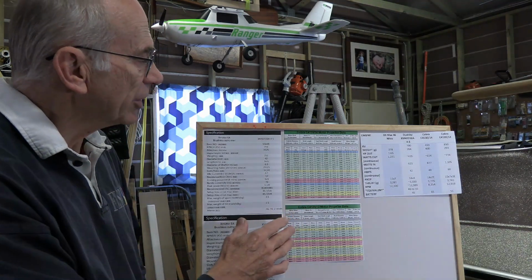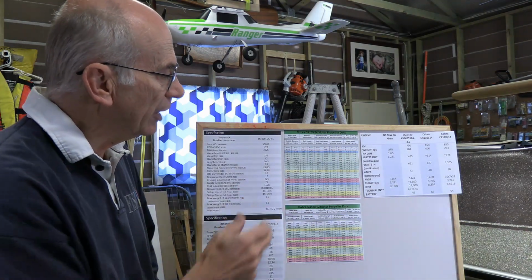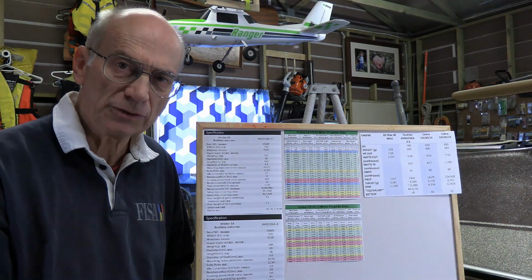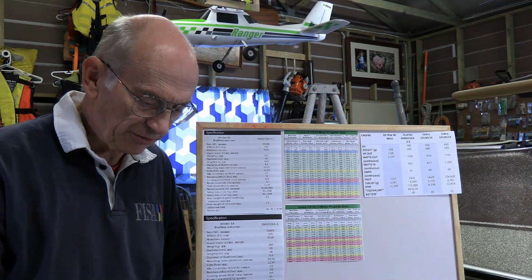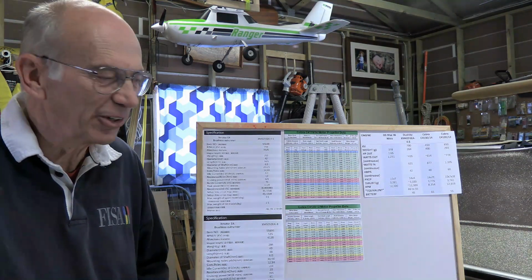Now, just thinking a little more about this chart, I mentioned the colors on it. The green is saying that it's running reasonably efficiently, and it's within the limits of the amperage the motor can handle. When you get into the yellow, it's saying that it's running very efficiently, but you need to be careful with regard to the use of full power; you need to limit full power to short bursts and things like that. And then the red is saying, hey, whoa, it's no good. That's going to draw too much current. Essentially, as we've mentioned before, brushless DC motors are going to draw whatever current they want from the battery, and the battery can deliver the current, but the systems can't handle that level of current. They get hot and they melt and cause all kinds of problems.